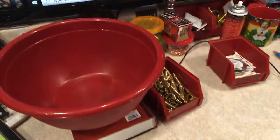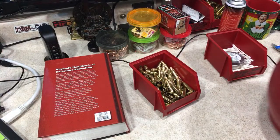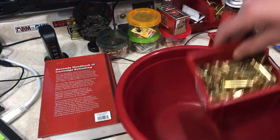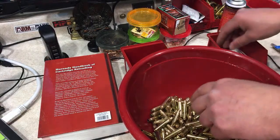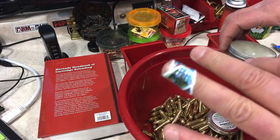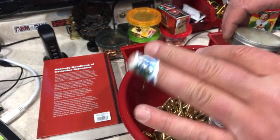So let's get this brass. I know some of you guys have already seen this before, but I need to do it again. I hate to go through this again, but I have to. I need to bump this brass back 2/1000ths of an inch, because 1/1000th of an inch is definitely not enough. We got our Imperial case wax, and I went and cut my finger. I don't know if you guys have noticed my amazing Band-Aid. It's the SpongeBob SquarePants edition.